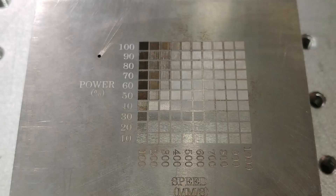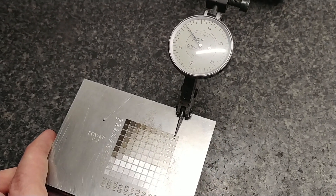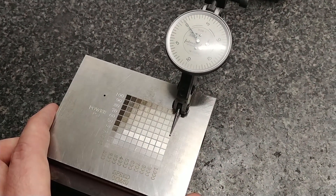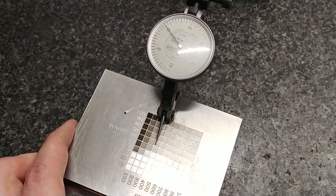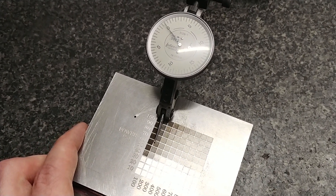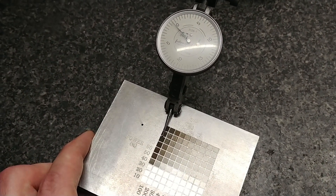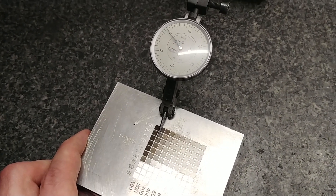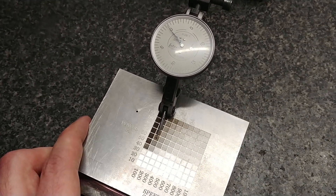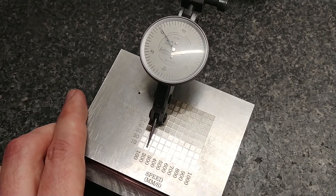Here's a close-up picture to give a better idea of the end result. After marking the S7 block, we put it on a surface plate with an indicator to see what effect the laser had on the surface — some marks are just a few tenths, but some are a full thousandth. If you didn't see the original video where I marked aluminum with my 20-watt laser, you can find it via the links on my channel. If you have any questions or thoughts, feel free to leave them in the comments.